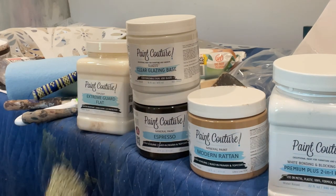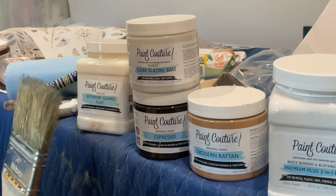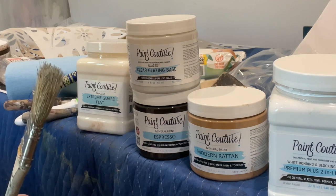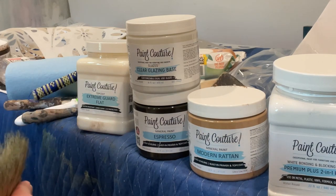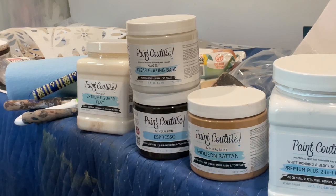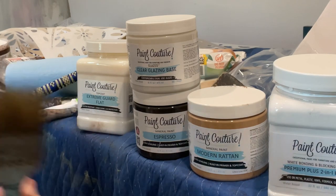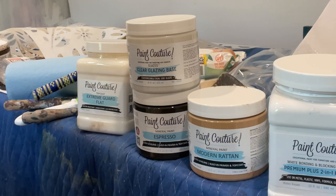It's really important to condition your brushes — especially chip brushes, because they're prone to losing bristles quickly when you first start using them. You don't want bristles flying out, especially when you're doing this technique. To condition them, run them under water, then fluff them and pull at the bristles. You'll see that you get a bunch of loose bristles out.